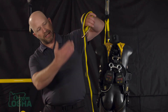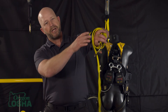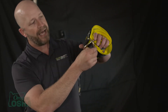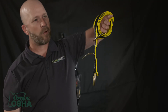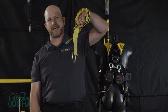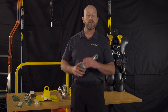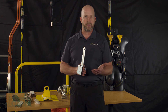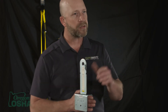If you're using a horizontal lifeline, in many cases anchor straps can also be used vertically. They're designed so that if necessary you can do multiple wraps — just make sure it always pays through all the way so you can get the connection as close to the anchor or structure as possible. Get a full choke through, make it line up, get tension, and it will hold its position giving you a correct, compatible connection for your anchor or lanyard. It is still imperative on site that, other than following manufacturer's instructions, you verify the structure you've fixed this to — it shouldn't just be something random.